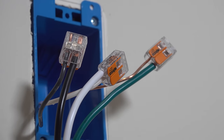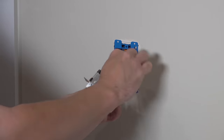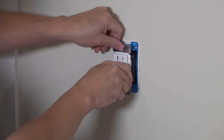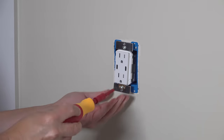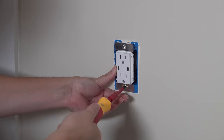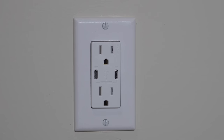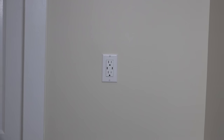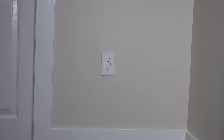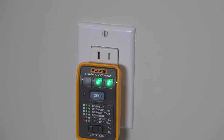With your three wire connections made, all we've got to do is insert this back into the box. This is a big outlet so you'll want to take your time to bend the wires around to get them to fit neatly inside the box. I often like to slightly attach two of the screws and then use the outlet itself to push the wires back. If you have any doubts that you haven't made the connection properly, just unscrew the outlet, take it back out, and do a double check before you finally tighten those screws down. Now that this is installed it basically looks like a regular outlet, but this is also a tamper resistant model. These guys have figured out the lever system inside and when you put a plug in I don't seem to have to fight with it anymore like I used to. I'm also going to use this Fluke meter to instantly test the outlet and make sure that my electrical power is correct. Two green lights mean that everything is working properly.